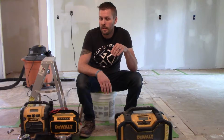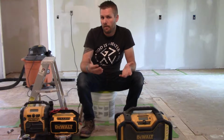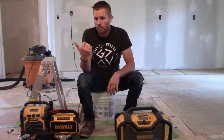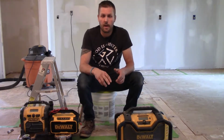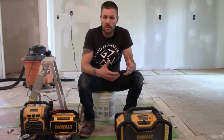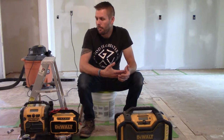So generally, if it was coming through a wall, I would probably leave it higher and then just try to do a 90 degree down to the heater, because the heights can vary quite a bit on water heaters and depends on the gallon size and what you're putting in. So in the case of this water heater, had it not been in there, what you saw me do was I just pushed an extra amount of pipe up into the closet, and then I cut the pipe off at the height. I put the SharkBite flex lines on the top of the heater, which I prefer to do. That way, if the heater ever was to get moved, or you would need to drain it, or whatever the case was, you're not hard piped into the line and you're not going to put a bunch of pressure on your plumbing. So I like those, and that's what you saw me install.